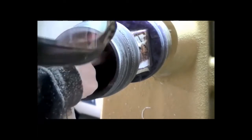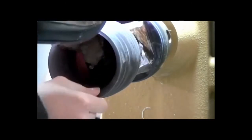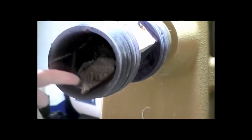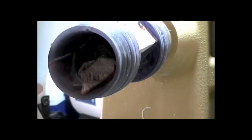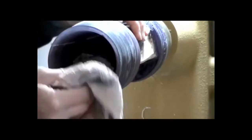Well, if those are my only defects, then I did okay, I think. It looks really pretty. It goes right with the curvature. I can't wait to see this piece of wood sparkling. Just make sure whatever sanding sealer you're working with isn't oil-based, obviously, if you're going to put it on before the resin.